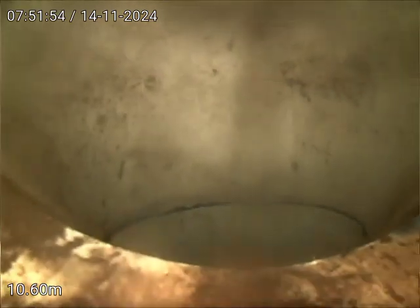We're 600mm deep below the concrete driveway. We've got 700 from the TDM. We've got a dropper here as we go around — it's only another probably 6 inches or so, and then there's the pipe. I don't know if that liner is resting on the pipe. It's got a little drop — about 150, something like that.